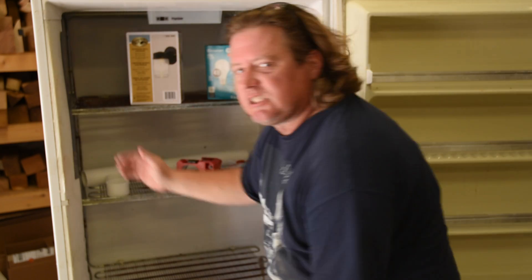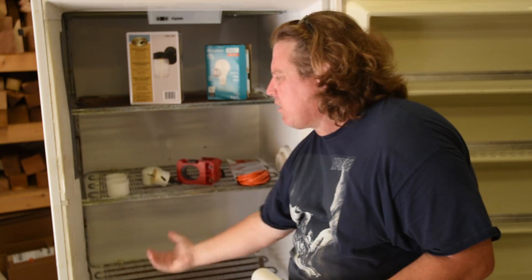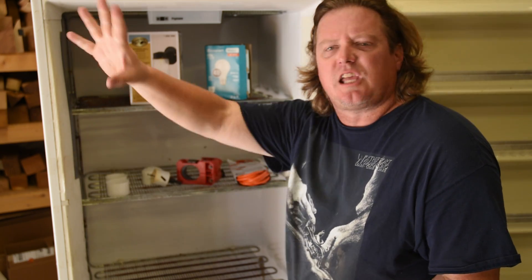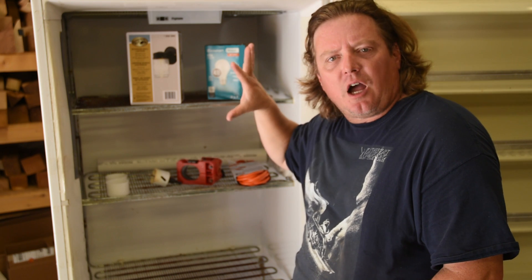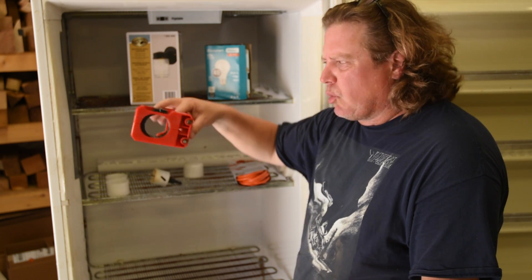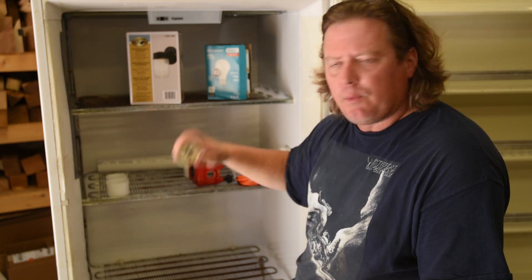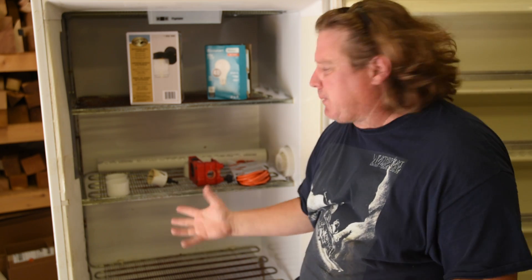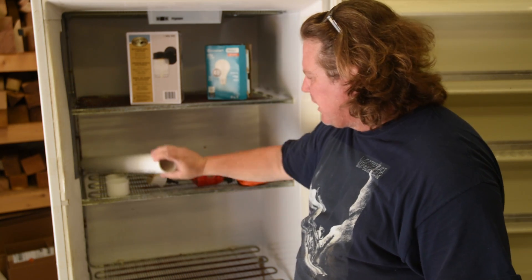You're going to have to cut holes in the side strategically. I bought PVC pipe to insulate those holes because you don't want water coming in underneath — you just want the water to escape out. I want to be able to plug them up to restrict airflow and control moisture content so it gradually lowers down. To cut the holes, I had an old door-lock hole jig and I'm using its two-inch hole cutter, which precisely fits a two-inch pipe. Very inexpensive — I'd say I've spent about twelve to fifteen bucks on all this, but we are talking low-dollar for a working kiln.